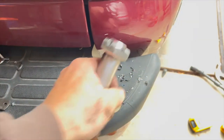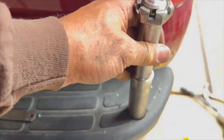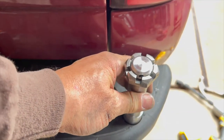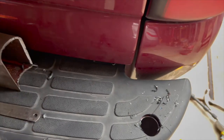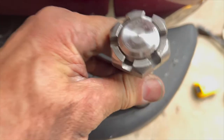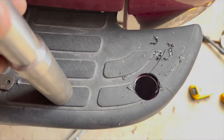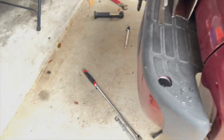I'm going to take this top cap off because I'm going to weld that spindle into the top cover of the bumper just for another anchor point. Then, as I showed you before, with the 2x2 inside there, I'm going to weld it into the 2x2 at the top and the bottom of that tubing. I'll probably need to cut another hole through on the drill press.